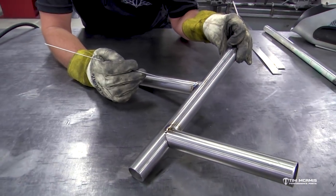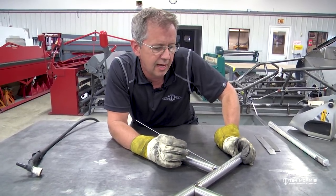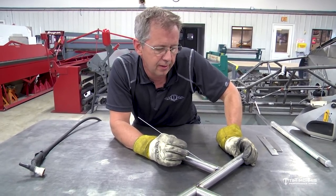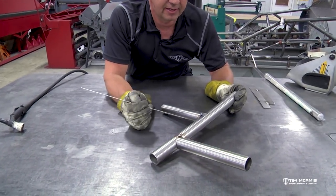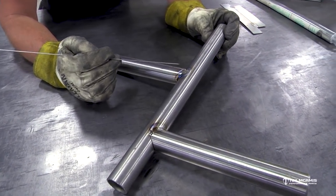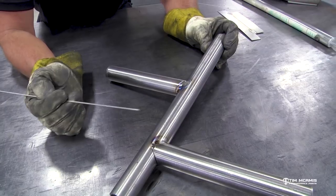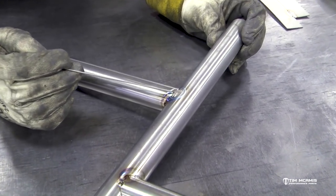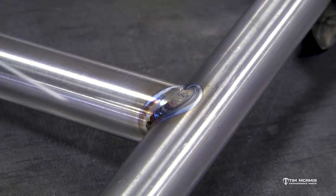This is what it should look like. This is too hot. This isn't damning by any means — it's still usable, it's just not as good of a weld and it's gonna be more brittle because you've got this tube so hot. You really need to keep good argon coverage on this. You're looking for something nice and shiny, not a lot of excess heat in it. If you get it too hot you're gonna see this, but I would still continue on from here, pull that around from this side and come back up to this point, just flood this with argon and it'll look fine. The consistency of the weld is good but it is way too hot, especially up on top where it gets kind of thin. You really got to pour some argon to that to keep the weld cooling down at a set rate.